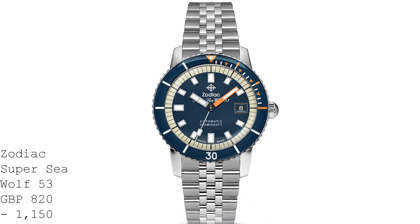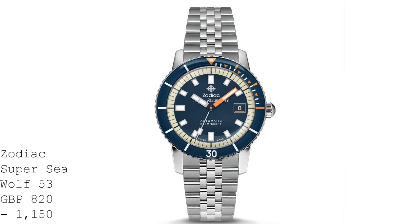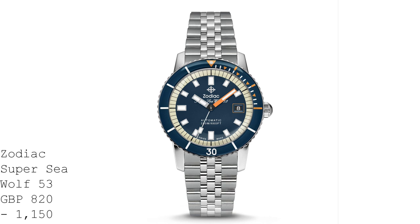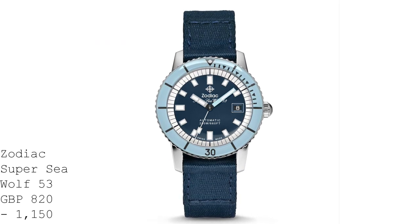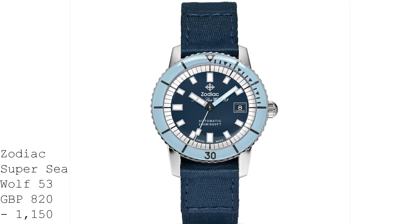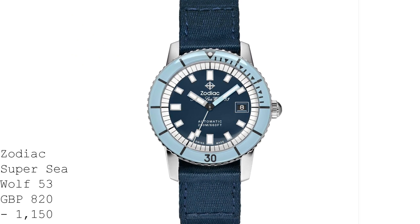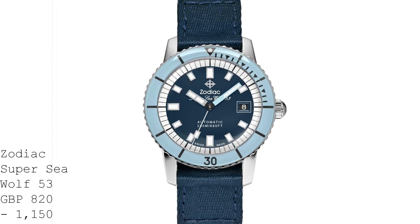The movement is also fully decorated, and that's not to say just the rotor on this piece, despite not having an exhibition case back, and it also has a swan neck regulator for fine adjustment of the balance, which again you just don't see at this price range on this sort of movement. Otherwise the movement shares the same specifications as the Sellita SW200, and it beats at 4Hz and has a 40-hour power reserve.